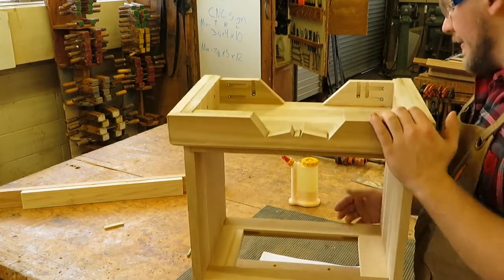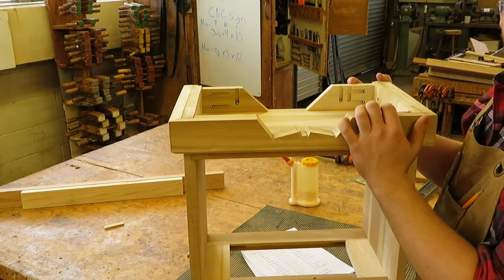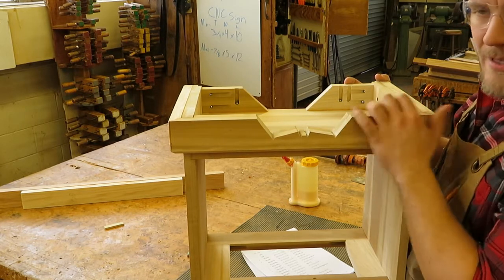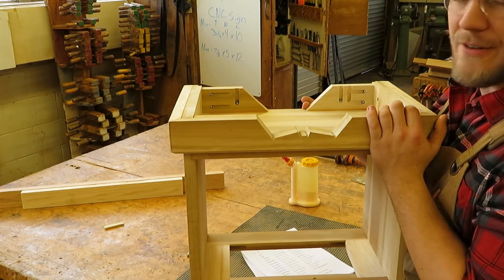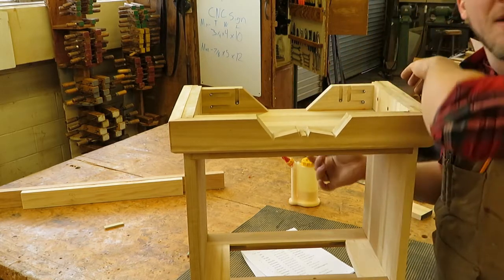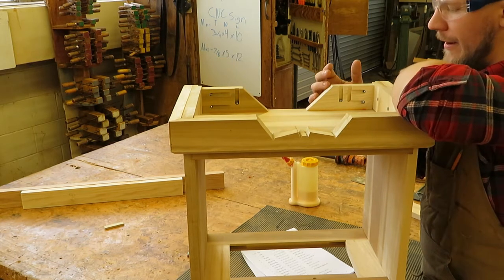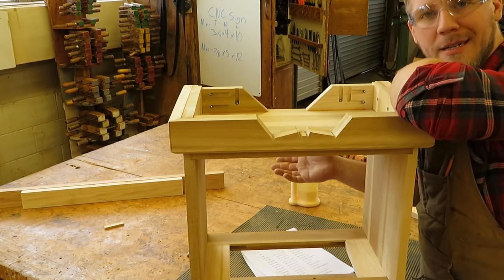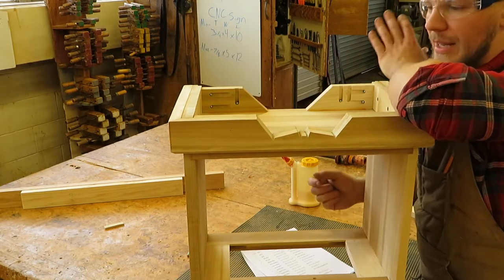Now in the back here, what we have is our back fillers. Basically, it's the same width as the front filler, but the length can vary somewhere between 6 to 4 inches, cut on a 45 degree. This can be out of any scrap wood you have left over. It's not particularly important that they are the greatest looking piece, because it's going to be on the rear part of the project. So again, this is just for structure, but not that hard to make.